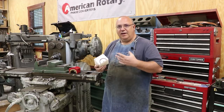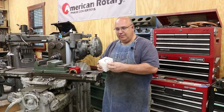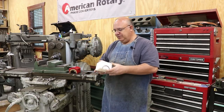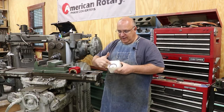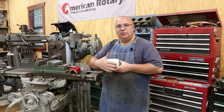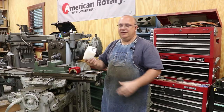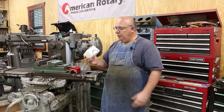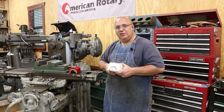This plastic is pretty slick, and again there's not a lot of speed here and really not a lot of force on it. It just holds things in place, and this plastic actually does a good job of lubricating and doing what they need. He provided me with some plastic, and I took it and squared it up over on the vertical mill — I didn't show that process, but I got it machined down to size. Now we've got to get this radius — I think it's inch and three quarters, I'll double check — and this part needs to be precision; it needs to fit the shaft exactly right. The top just has a radius on it which I'll cut on the bandsaw and finish on the sander; that's more decorative. But this bore is a fairly critical measurement — it needs to be the right diameter and true. We're going to use the horizontal mill to bore this out using a boring head.